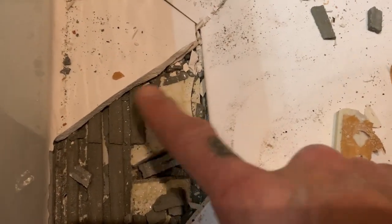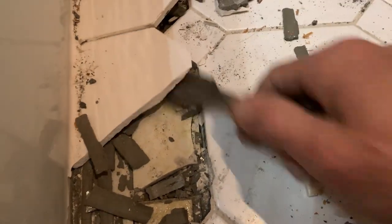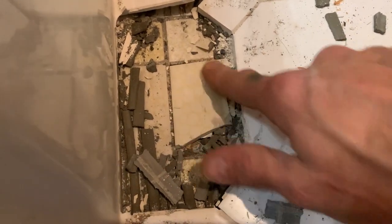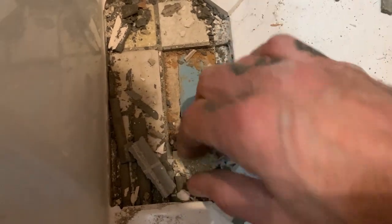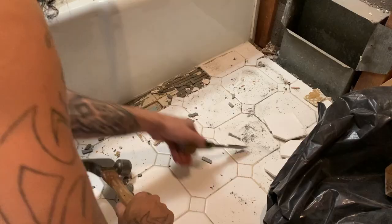Just like I thought. So we have old tiles, mortar, new tile. See how connected they are? Not very connected, are they? That's why you don't do that. Because that is a smooth, glossy, enameled surface. Mortar, almost anything, won't really stick properly to that unless it's etched or something fancy. And those tiles were not, I mean, I put a lot of force, obviously, just now, but it's not really down. If it just all pops and separates, there was no adhesion, no connection. You know, c'est la vie. Let's get it up.